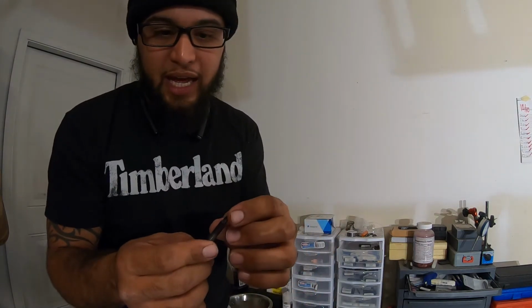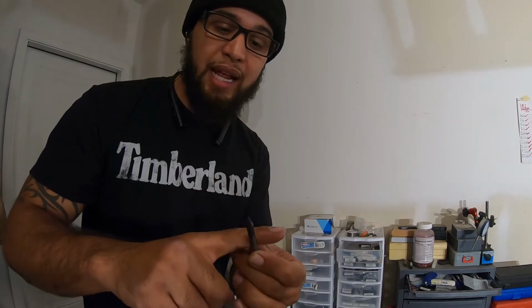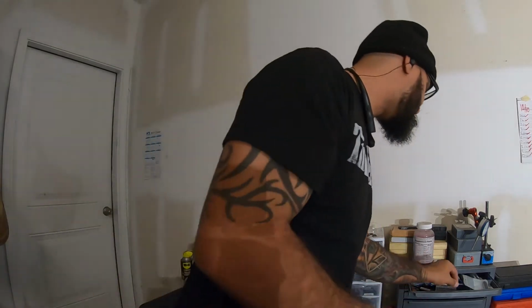But I'll tell you what, I had the worst luck with these things. But once I figured it out, I pretty much got it down to a science. If you guys want to see a video on how to use these Lakeshore carbide engravers, just let me know, comment at the bottom, and I'll make a separate video, but include this one in it, so you guys can watch me and how it cuts at certain speeds. And pretty much the feed rate is a big key on this, and obviously the speed. You don't want to go too fast, but you definitely don't want to go too slow neither. So very useful, these engravers.